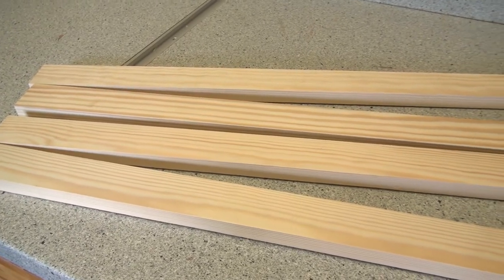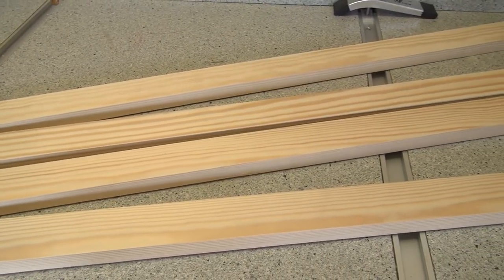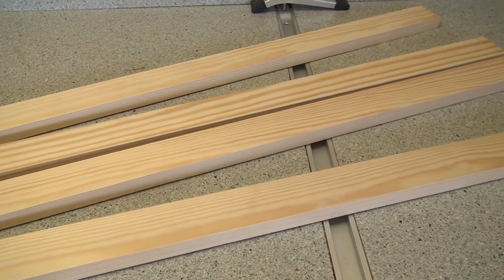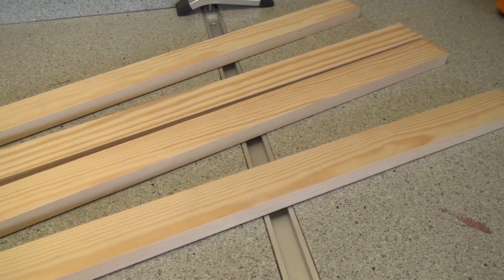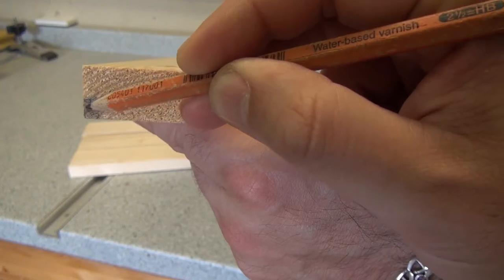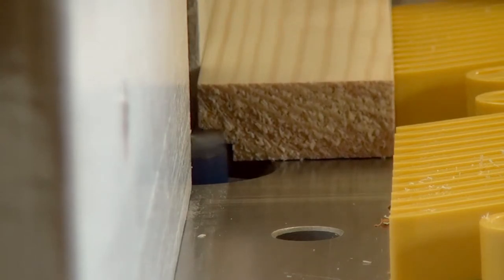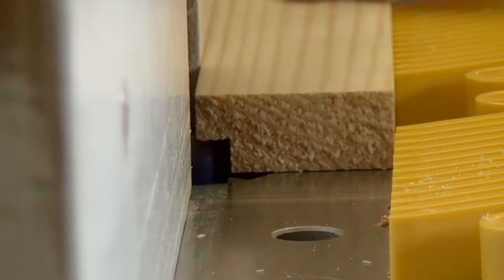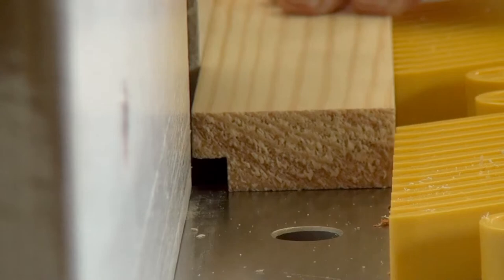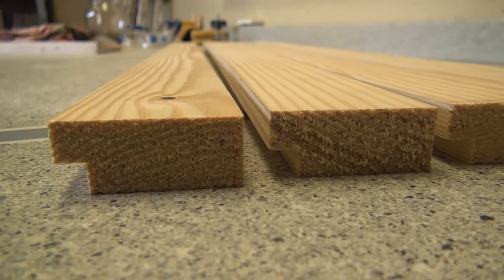The photo has a dimension of 60 by 40 centimeters, and for this frame I will use rectangular strips made of pine that I've bought at the DIY shop. The first step I did was to create a recess for the back of the frame, which will hold the aluminium Dibond panel. To do this, I have used a straight bit to remove some material in several passes, each time raising up the router bit by some millimeters.